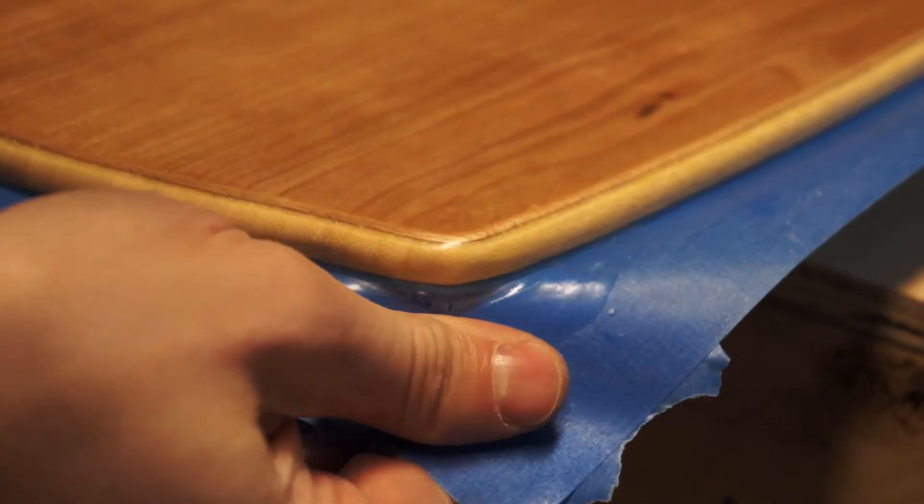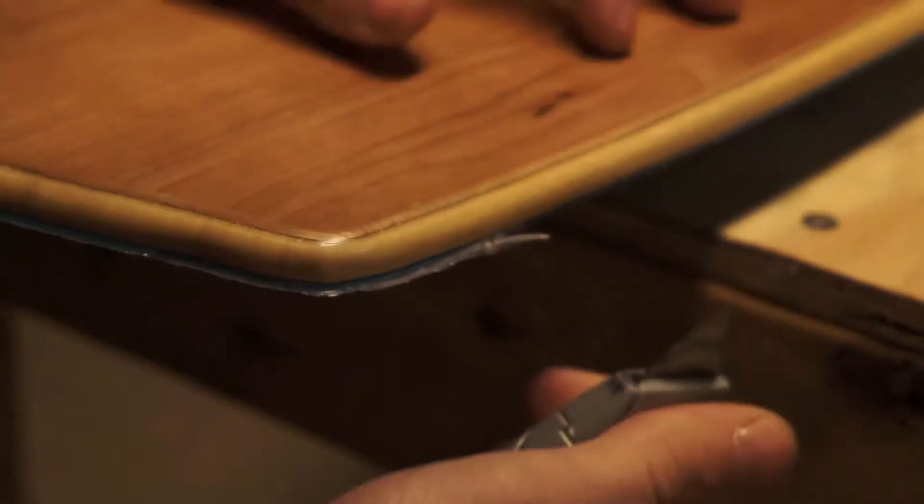If this doesn't work out, or if you're a little shy about experimenting with water-based finishes on something that's going to be in water — frozen water, but still water — an oil-based polyurethane or spar varnish will go a long way. After the finish is applied, we pull that tape off. There's a little extra finish around the edges where it pulled, so I'm just cutting that off using a utility knife, trimming the flashing.